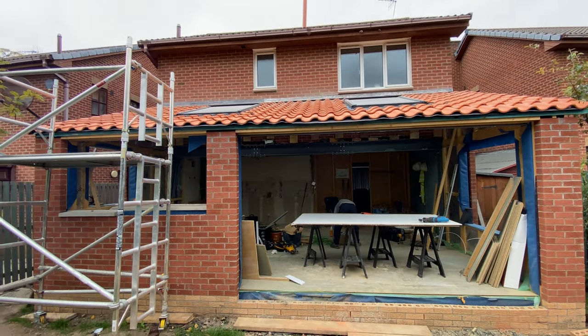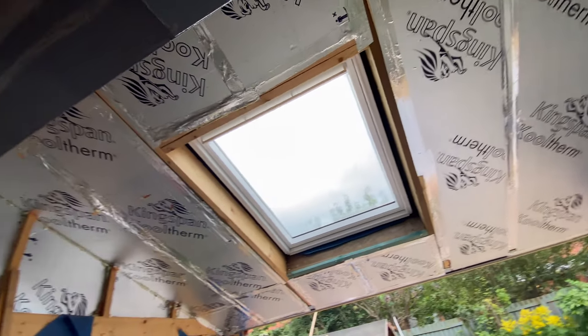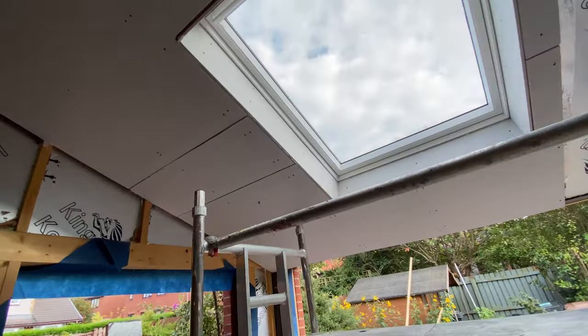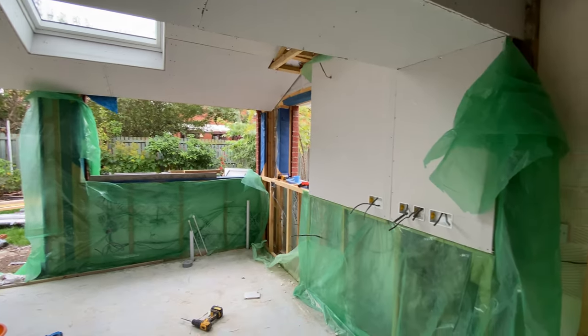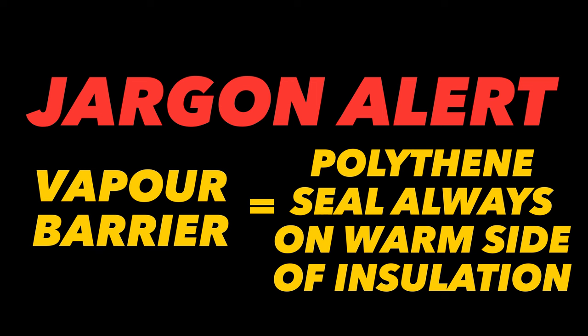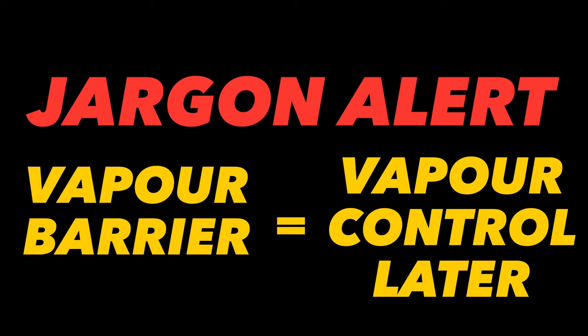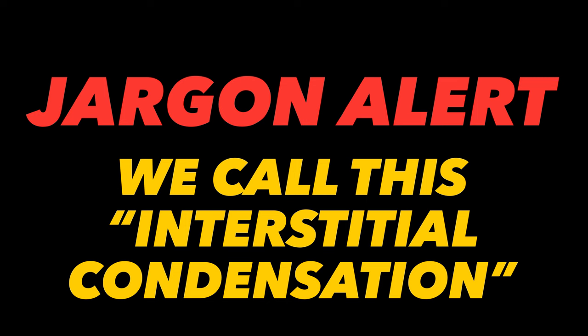With the roof and wall sealed it's time to get our insulation cut and installed — not the most enjoyable part of a build. Make sure to have personal protection when you're cutting this stuff. We'll use expanding foam and foil to secure the batts and cover any gaps, and then it's time to protect from condensation by installing a vapour barrier over the floors, walls and ceiling. Insulation and its proper installation will be the difference between a comfortable and economic living environment and a troublesome space to heat or cool, with the potential for damp and rot. People tend to scrimp on both the materials and the workmanship, and I promise you will regret it for years to come if the insulation and vapour control layer aren't installed with care and rigour — warm vapour from people and cooking will condense where it meets the cooler outside air within the wall and roof voids.